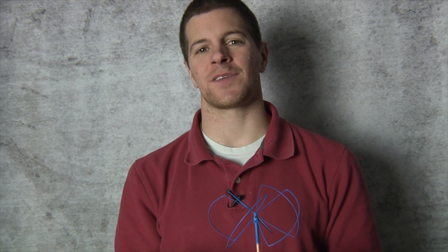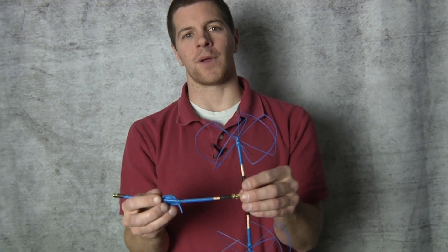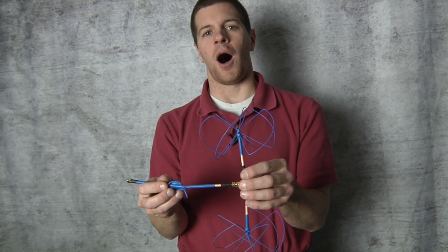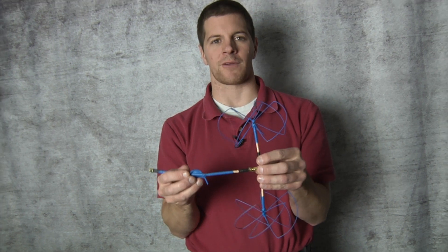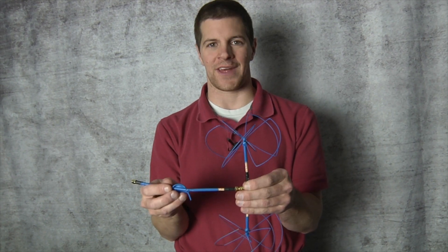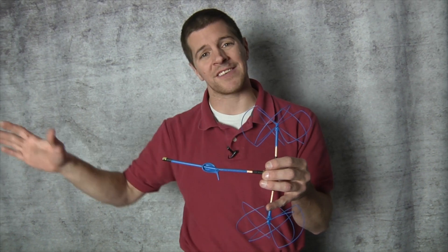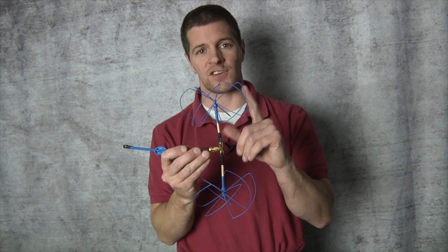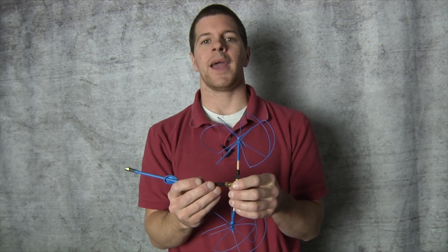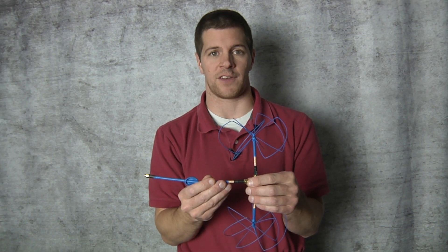Hi, I'm Alex Greve, aka IBCrazy, with Video Aerial Systems, and today I'm going to bring you the SkyHammer. The SkyHammer is a 4.5 dBic omnidirectional circularly polarized antenna with very high axial ratio. That simply means it is higher gain, which means you can reach out about 60% further than just one antenna, and you get a higher axial ratio, so better ability to reject reflections.